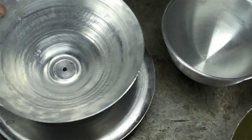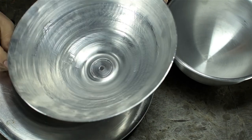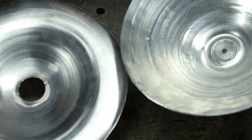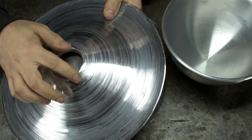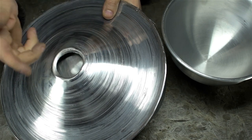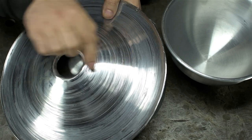And for me personally, the bearing tool, the bearing on the stick that you saw, was a lot easier to control than the blunt stick. But the blunt stick was giving me a lot better surface finish than the bearing. You know, I got some galling here. That's probably more technique. The business end was pretty polished. I don't think I had any weird scratches or bumps that would cause that kind of galling. Probably just inconsistent pressure on my part.